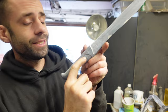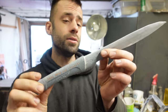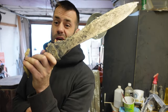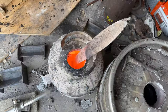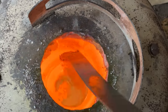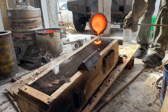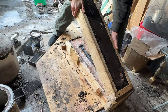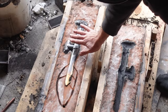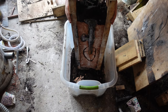The mold is made, it looks good, except all of this lettering pulled out of the sand. I expected that it would. Now the question is what kind of metal would a blade like this look good in? Tin bronze, silicon bronze, aluminum bronze, Nordic gold — I'm just going to melt down this bronze sword that didn't turn out before. Tin bronze it is. I'm going to put the whole sword in all at once — it'll melt eventually. And it did. Time to pour it. Houston, we have a problem. Unfortunately, the metal didn't flow to the tip of the blade. I'm sure many out there saw it coming and know exactly what I did wrong, so feel free to let me know in the comments. I gotta redo this.